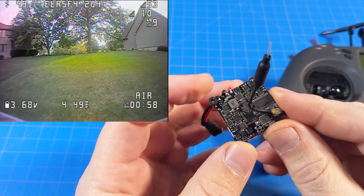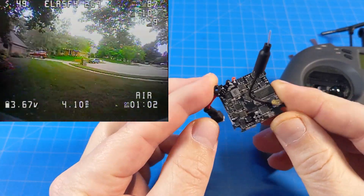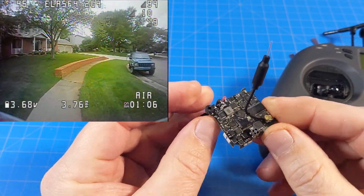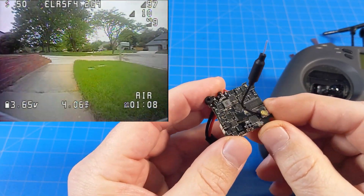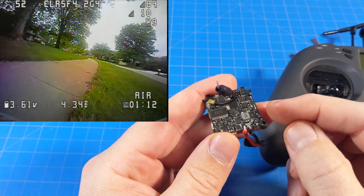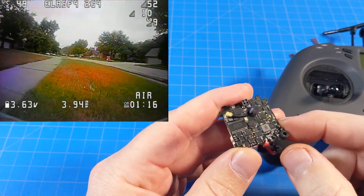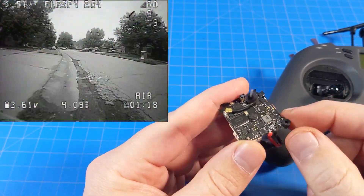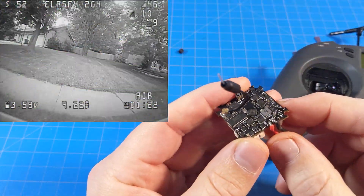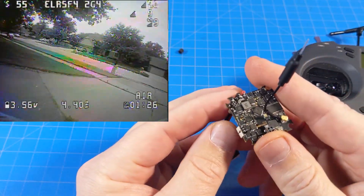This is the front of the board now, so our pigtail has changed locations — everything's kind of been rotated. We still have our USB port here as well, so that's something to be aware of. You can change this; you can turn that back around. Then in Betaflight, you can use the controls to rotate on the yaw axis 180 degrees to return it to what we're used to. Old time grizzled veterans might want that pigtail out the back, but as of right now, it's out the front.